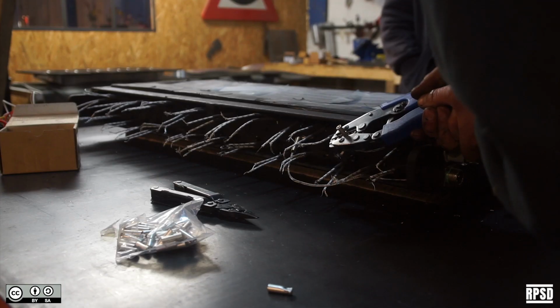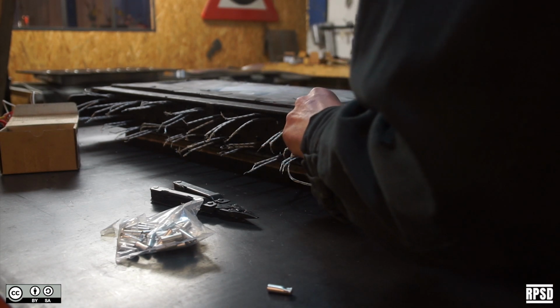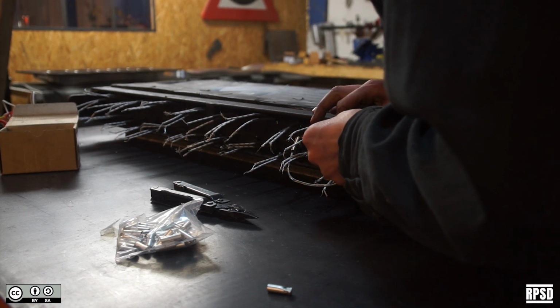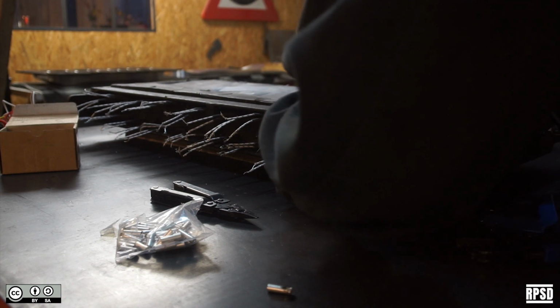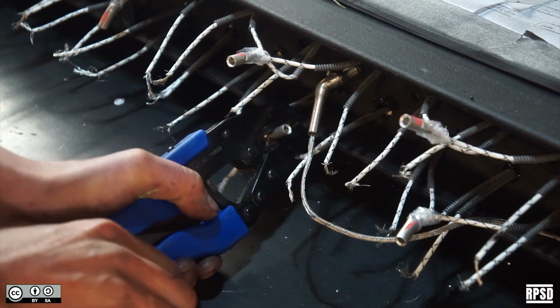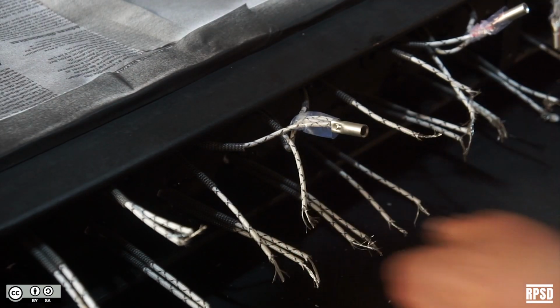Make sure that the phase that has the extra cartridge heater is not the same phase that powers the components inside the enclosure, such as the fan and the LEDs, as this will draw too much current on the same phase. The cartridge heaters are connected by splicing the wires together and then protecting the joins with heat shrink.